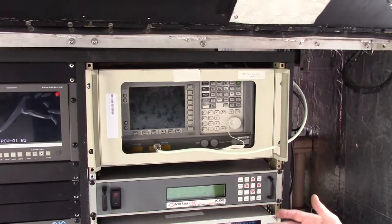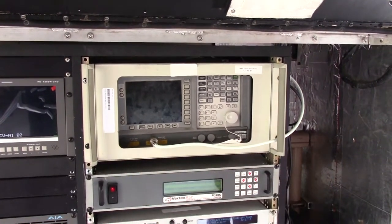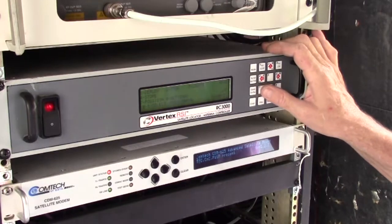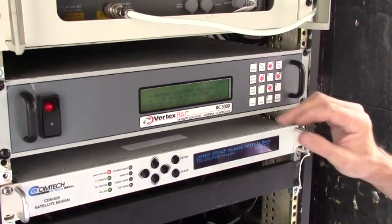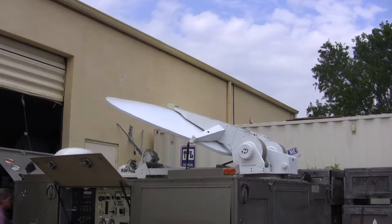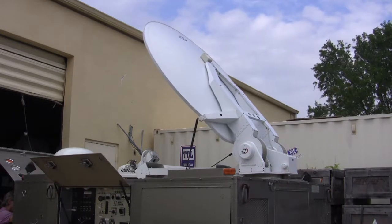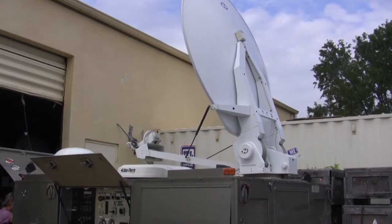In here, the RC3000 — the antenna controller — we'll boot it up. The system is just powered up, so the first thing it needs to do is learn where it is. Antenna deployment is required to initialize position, so in order to deploy it just hit enter. What this is going to do is make the antenna stand straight up, because the compass is on the back of the antenna. When the antenna is up it's on the top of the antenna, and that's the only way we're going to get an accurate reading.